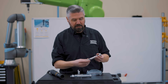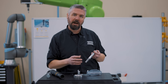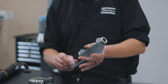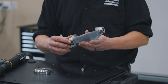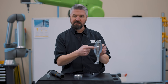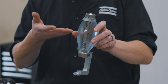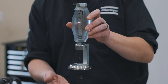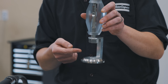Let's talk about the importance of clamping force. We know that a bolt needs to be tight in order to do its job. If we just assemble the parts and run the nut down until the parts are closed without any real tightening, the load is about zero but the joint is completely closed. If we ask this bolted joint to take some service load, the load will overcome the tension of the bolt and pull the joint apart.